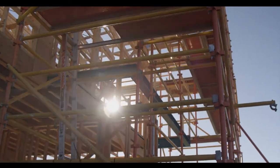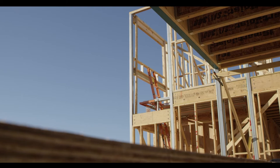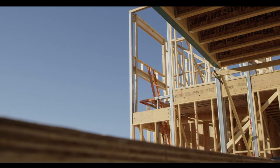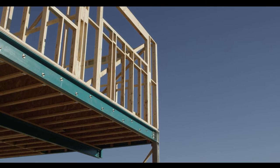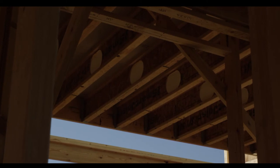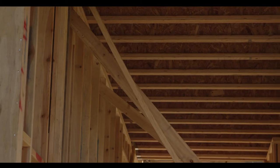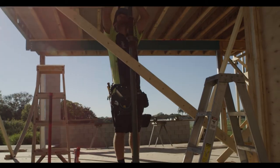Once the lower frames and the structural floor members are complete, we install the floor system, which is an engineered design floor structure made up of a series of laminated beams and floor joists. You will notice the floor joists have pre-cut holes which allow for the air conditioning ducting to pass through without altering the structural integrity of the joist, all while staying concealed within the floor space. The particle board flooring is glued and fixed to the top of the joists, which will allow the upper floor set out to begin.